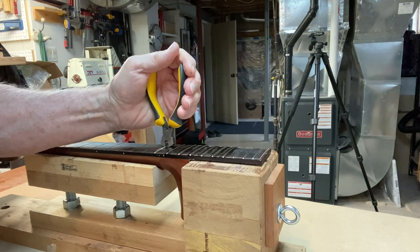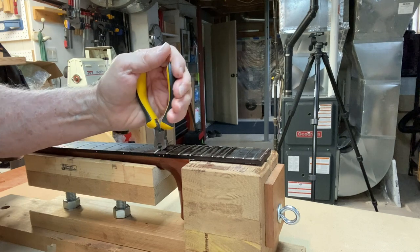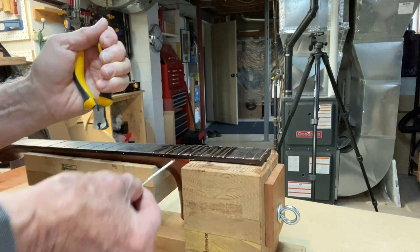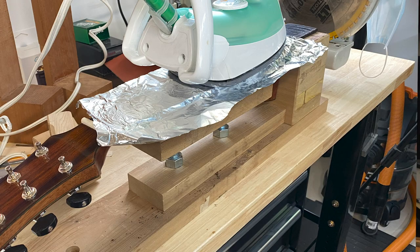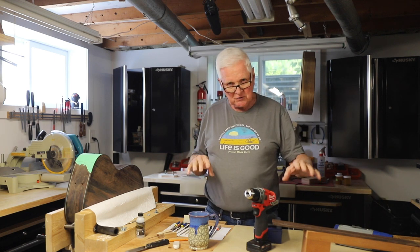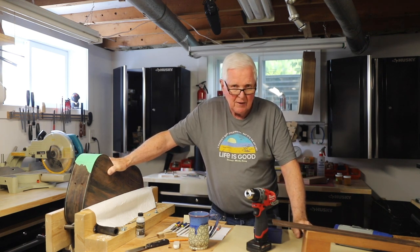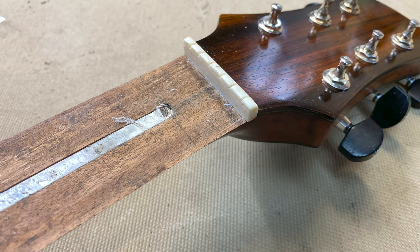Now that the frets are all out, I put the neck in a support piece — a jig I have for supporting the neck — and then I put the iron on top of it to heat the wood. Initially, because I did not want to burn the wood, I put a piece of aluminum foil there, and then eventually I took that aluminum foil off. The key here is to use gentle heat — you're not steaming the wood, you're not getting into a high heat because it could damage the wood. You want to put that on there so that when you pick the iron off and feel the wood, it's warm to the touch, not hot. Then get the spatula in underneath and start to very gently wiggle it until you can see the glue starting to come up.